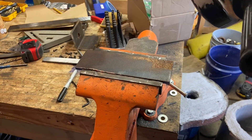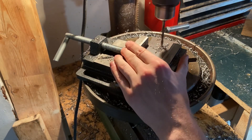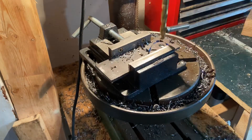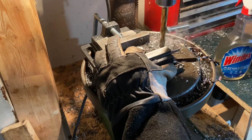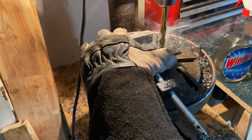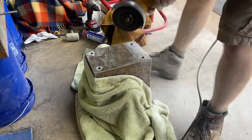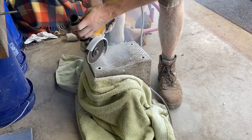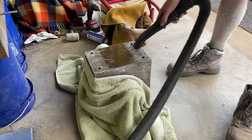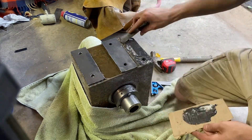The last piece I put together used some more scraps of old rusted steel. These are going to be basically washers for the top of the headstock. I've got bolts going through the entire headstock bolting it down to the body of the lathe, and the nuts on top would do better against steel rather than pure epoxy granite. So I'm going to have these with holes through them as giant washers on top, with an epoxy joint between them and the actual headstock to ensure good contact area. That's why I cut these slots — just to give the epoxy a little mechanical connection. It only took maybe an extra two minutes of cuts with the angle grinder.